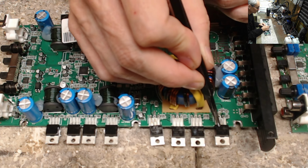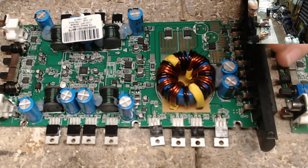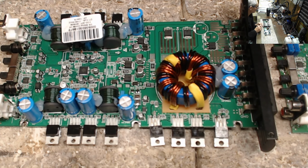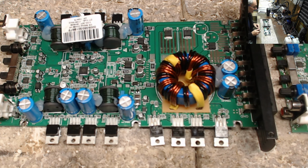They do have the 1404 installed here. The board is labeled to use the STP180Ns. The STP180Ns are just excellent transistors all around in general. The revision 2 board calls for the CSD18502s. So you can see that they've been kind of changing things around as the board revisions have been going along. But the CSD18502s are another very, very good transistor when it comes to current carrying capabilities.